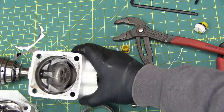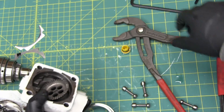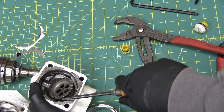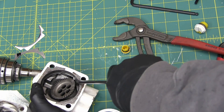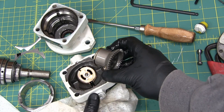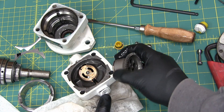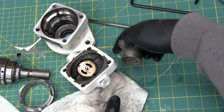Here's an interesting feature we saw when we split it apart — there was a big gap there. The back section doesn't actually seal on the front section, and there's an intermediary gland with all the O-rings in there. That looks like a Teflon seal, but it's actually paint. So just a couple of O-rings and no backup ring at all is sealing that — maybe 20 PSI of case pressure. That's how that goes together. Now this is a bent axis motor, and I'll see if I can get that to pop out there. I'm not quite sure how this is supposed to work, so I'm kind of just figuring it out as I go.